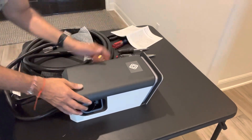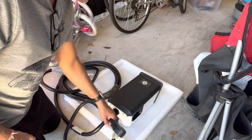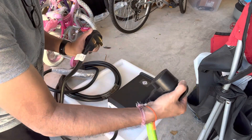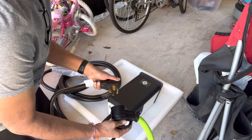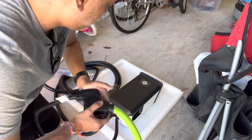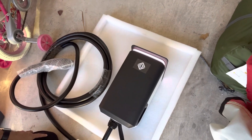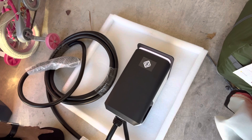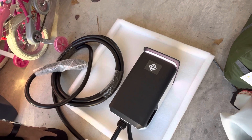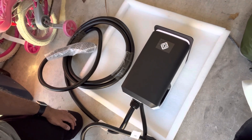It's all connected. Now we'll go plug it in and see if it works. Here we are in the garage — we'll test it using a NEMA 14-50 extension cord just to make sure it powers up and everything looks okay. We'll mount it properly after. Plugged in and it lit up — looks like we're good. We'll get it installed, set it up through the Rivian app after mounting, and that's how you put a pigtail on the Rivian wall charger.